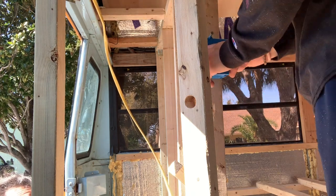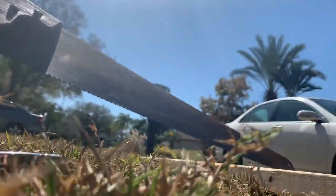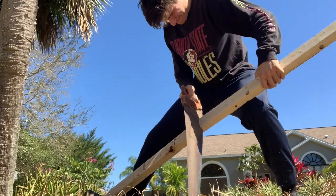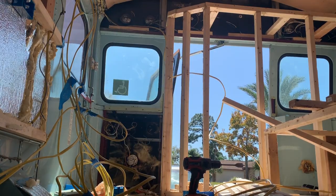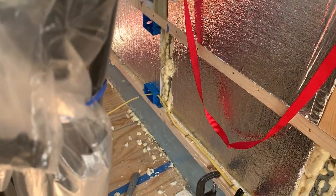So this is probably perfect actually — is it a quarter inch that you're putting on there? Yeah, because that's important. Who needs power tools? I need power tools. There we go — put the screws in it. In case of emergencies, plug something else in, because the fridge will have it on a 20 amp breaker, but realistically it's not going to need that. It's very low wattage.